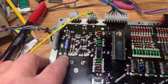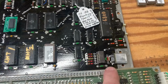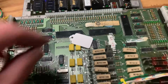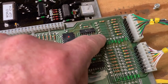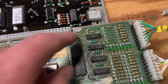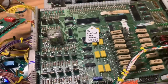5-volt cap, updated the reset section, modified it to be a System 4 MPU, and the modification of the clock section had already been performed. Driver board, replace the resistors in this section in the switch matrix with 0 ohm jumpers. That is correct. And let's see, that's it for this. Oh, all the headers all the way around.